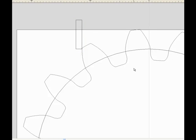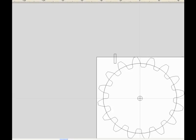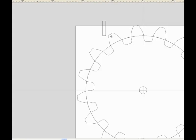For example, the blank for this gear should be exactly a radius of 45 millimeters by definition. This was a 90 millimeter wide gear. However, if the tool was not zeroed exactly at 45 millimeters, even being 1 millimeter less, 1 millimeter closer to the center of this gear, could make the math point this tool 2 or 3 millimeters to the side. So it wasn't an uncommon complaint that someone would say, I have been cutting my gear and the tooth is not touching the tool on the final pass. And this was always an indication of inaccuracy in setup.